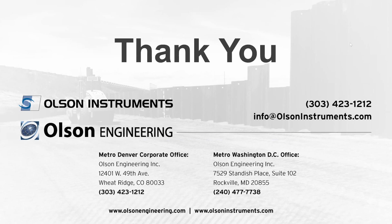Yeah, I'll mention, and Pat knows this too, Professor Mitra at Oklahoma State University was awarded a grant by the Interlocking Concrete Pavement Institute to look at the very coarse drain rock, very similar to railroad ballast, that they use under their pavements to check the compaction using an LWD approach. And we have a consulting role supporting him in his research, but he's just starting that research recently. So some interesting things may come out of that as well. He also is going to explore a larger diameter mold. I think it's nominally 12 inches in diameter. So a much larger mold is something he's exploring.